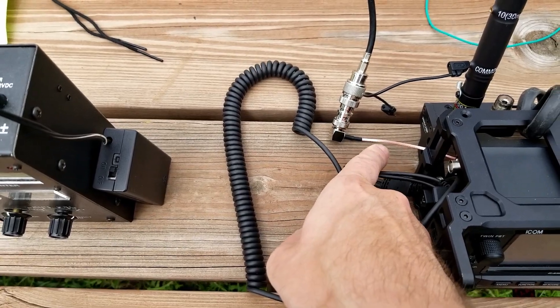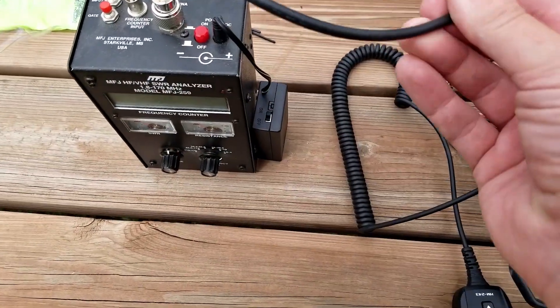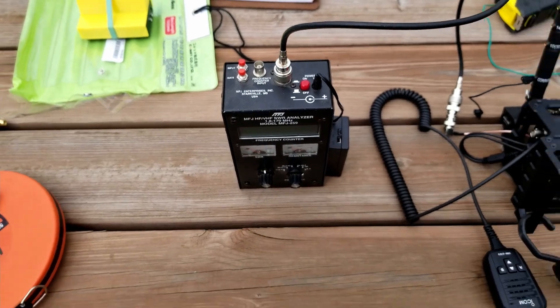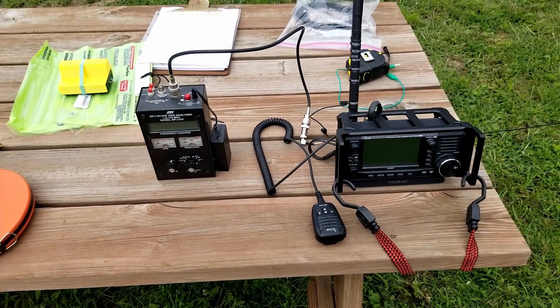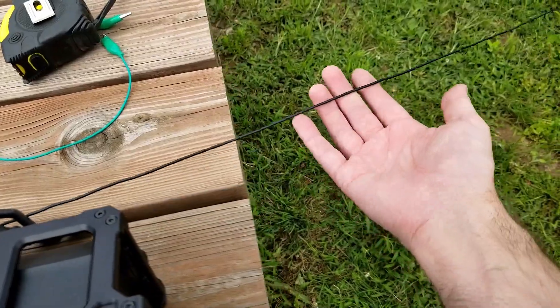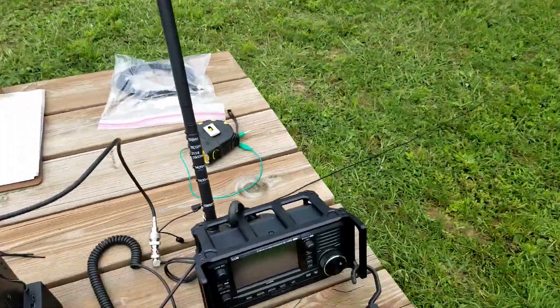What I'm doing right here is I have the antenna screwed into the PL-259 on the wind camp mount, which then comes out through — I think this is RG-316 coax — into a couple of adapters, into a piece of RG-58, into the antenna tuner. Right now I'm looking at the 160 meter band and I'm not having any luck. I need to measure out the counterpoise.